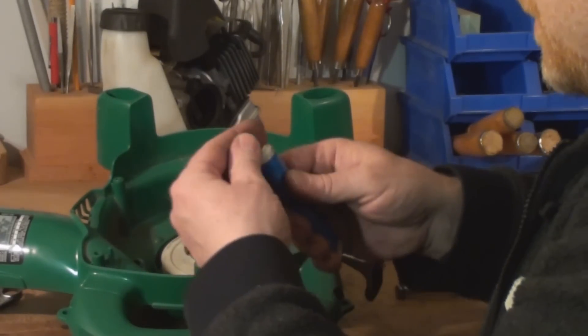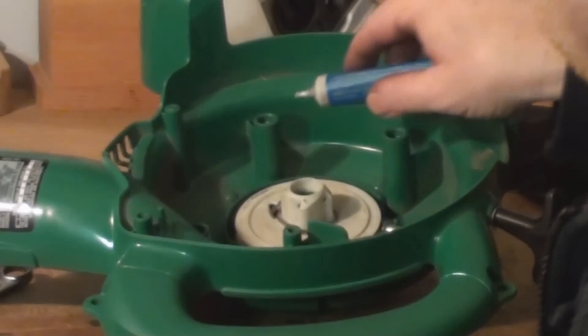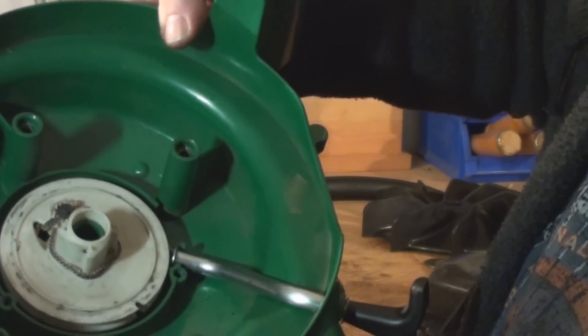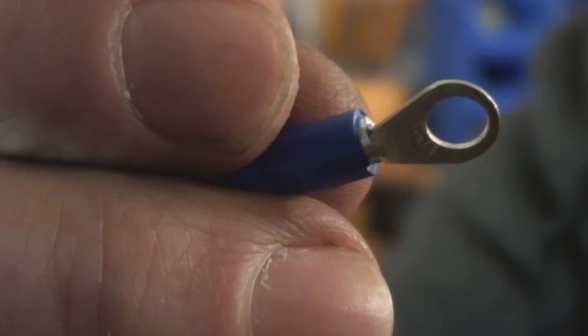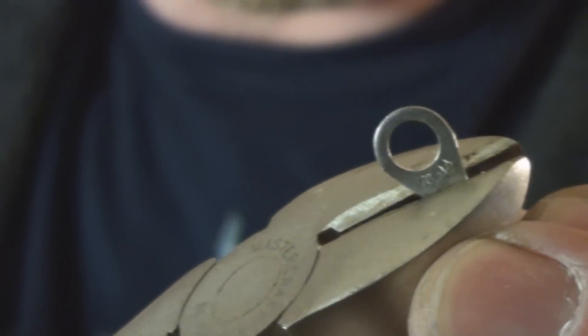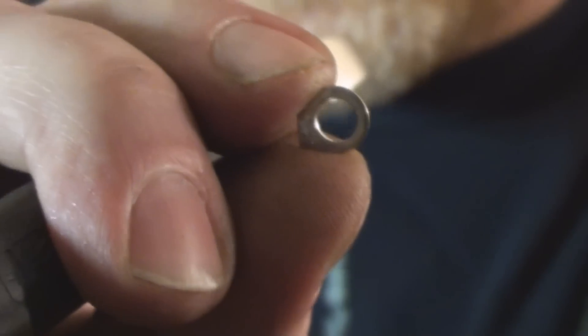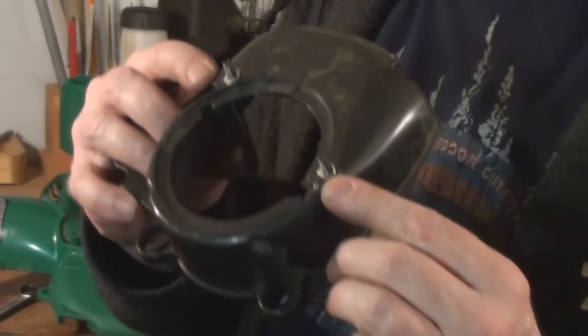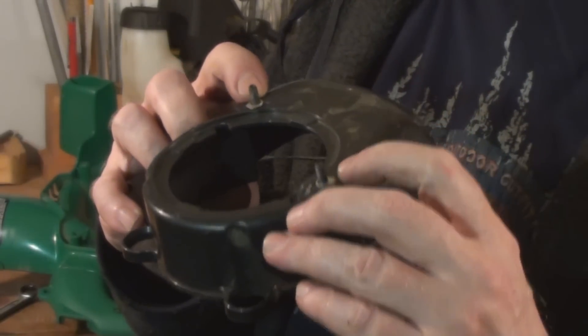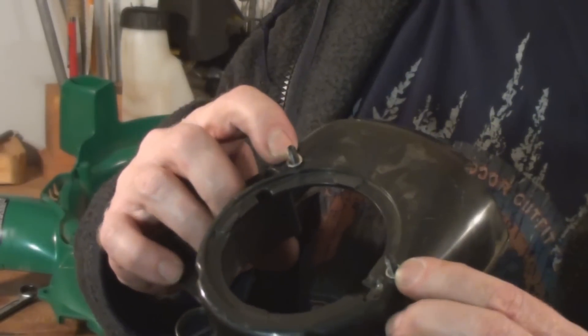So I'm going to make two modifications here. I'm going to add a little dry lubricant — this little bit of graphite dust powder on the outside edge here. Besides a whisper of dry lubricant, I want to add spacers here and here to push back the cover just a tiny bit. Unfortunately, I don't have any washers that are the right size. So what I'll do is take these electrical connectors and nip the end off with my side cutters. Just put that in there, hold on to this end, let that end fly. Voila! A homemade washer. I'm threading the washer onto the bolt — this should take care of my spacing problem. Back it off just enough so it will rotate freely. These homemade washers are a nice soft metal that'll crush down and conform.